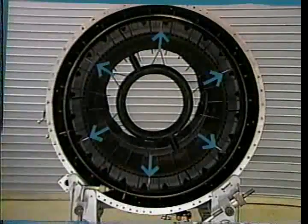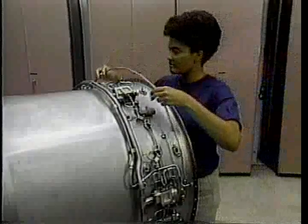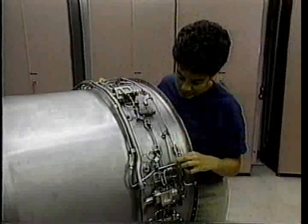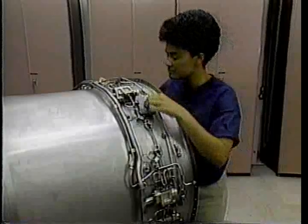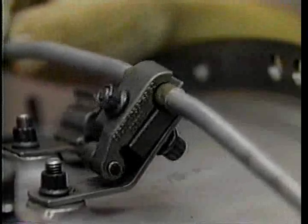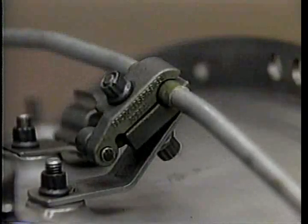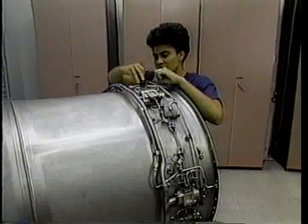After all spray bars are in place, install the upper and lower pilot manifolds onto the afterburner case. First, place the upper manifold in its correct position on the case, sliding it onto its only stud. Slip the manifold into the clamps, aligning the wear strips with the clamps. Then, leave the lock nuts loose enough to prevent stress.